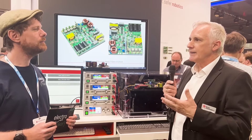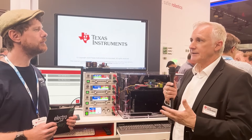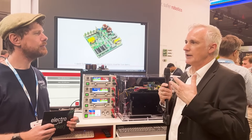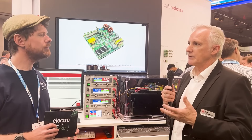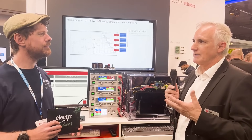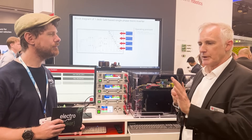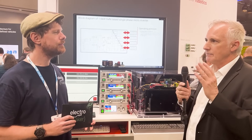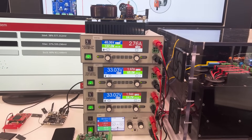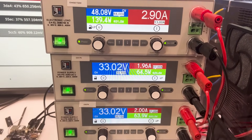What is really unique is it can be configured on the panel side with up to four batteries or up to four panels. The maximum power you can drain into the grid is 1,600 watts, which is quite remarkable and opens a lot of different application use cases — like a balcony application where you put multiple panels on the balcony and have a solar storage system, a battery storage system that can take all the excess energy, store it, and absorb it into the grid later on.